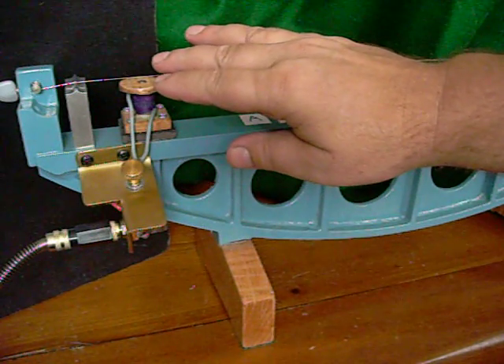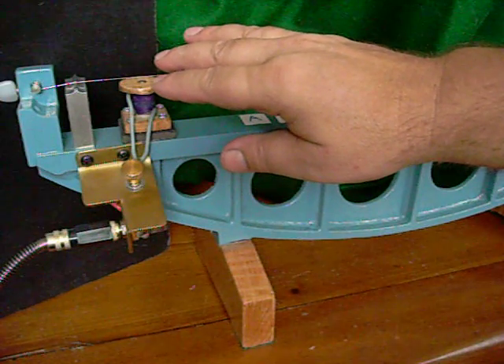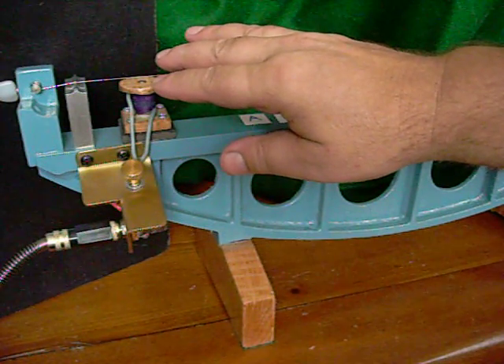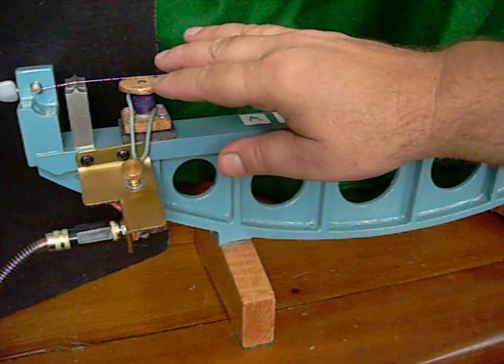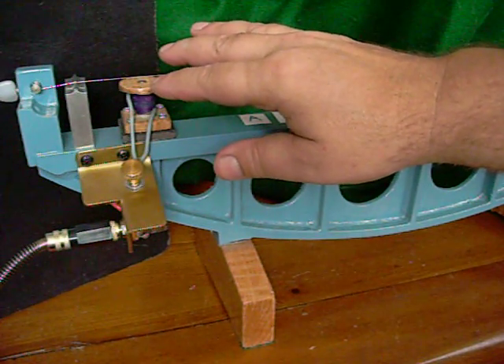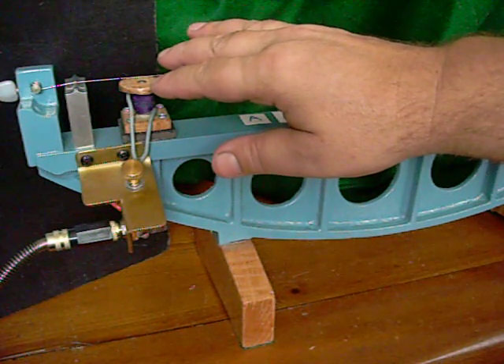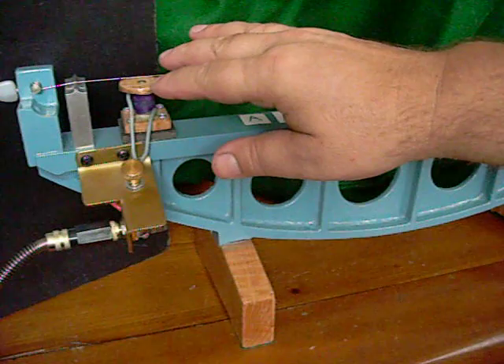I'm winding a pickup exactly like this one and running an extra tap lead out, putting extra turns on also, applying that to a two-way selector switch. So I can play with a clean winding like this and select it to a little bit of a hotter winding in the same pickup.